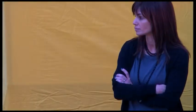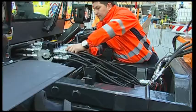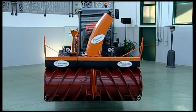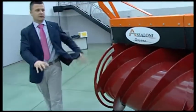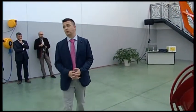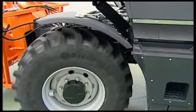This changeover will be quicker. The machine aligns and the attachment occurs. Front snow blower — indispensable for emergencies. The emergency requires a rotary snow blower capable of intervening when there are large, significant snow fronts. The operation of this large auger that grinds the snow is via hydraulic power. Let's go and attach the next implement.